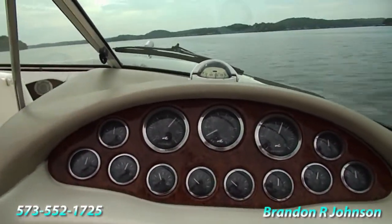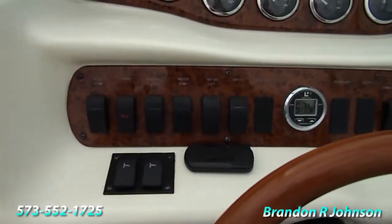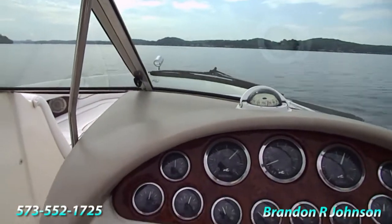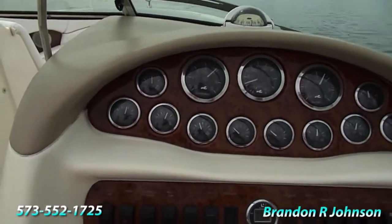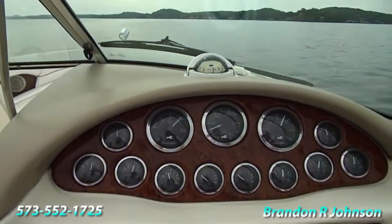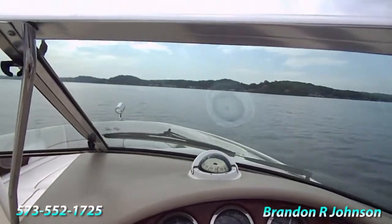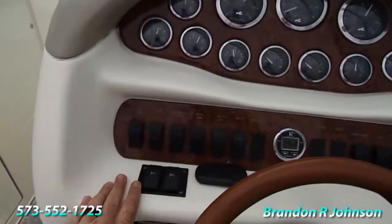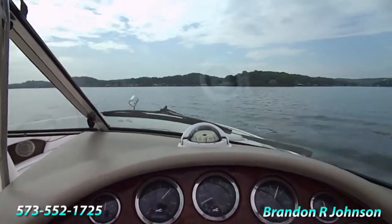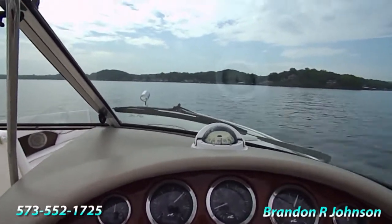But what I don't have a separate video on is how to operate trim tabs. So these are made for lateral stability right here. Okay? So if you got heavy people on the boat, you can level it out. But my intention is just to show you that they work. Okay? So I'm just going to do the port side down, not touching the steering wheel. See how the boat's turning now? Turning one direction. Right here. Now if we watch, I'm not touching the wheel. See how it straightens back out? So that tells you the port side tab works.